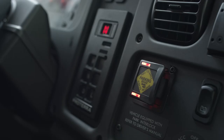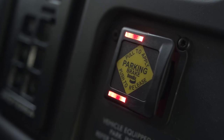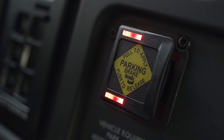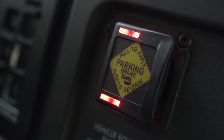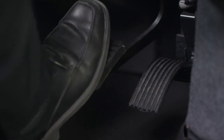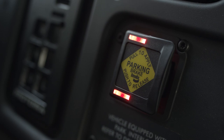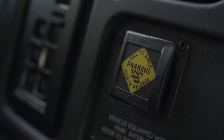Your parking brake is still set and the transmission is on neutral. The parking brake is controlled by the Intellipark switch from Bendix, which comes standard on all Jouley buses and makes it easier to set and release the parking brake throughout your day. The Intellipark switch sets the transmission to neutral when you activate it, which prevents the redundancy of pulling and pushing on a standard air brake PP1 valve. In order to deactivate the parking brake, you must have your foot on the service brake. Then simply push the Intellipark switch to turn it off. You'll hear a rush of pressurized air — this is your brake pump coming on.